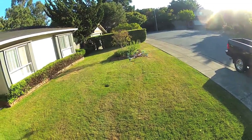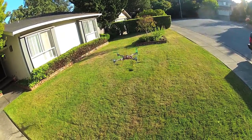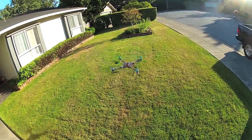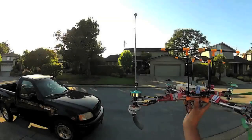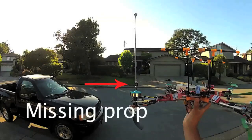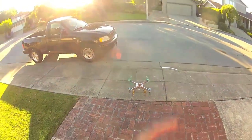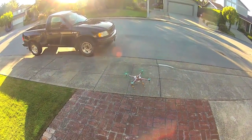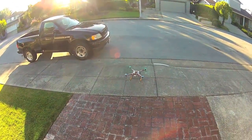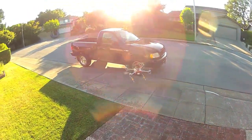X8s are sort of another example. I've built X8s before. They're very interesting, but it's basically a quad with 8 motors. You've got them top and bottom. I've had props disintegrate on X8s and barely could tell the difference. That's really nice. You get more rotational points, but again, you're increasing cost, you're increasing complexity, and the more components you put on, the higher the probability of a component failing is. But there's a sweet spot. I think the sweet spot generally tends to be the hex, and for beginners, the quads.